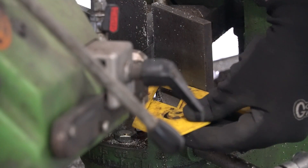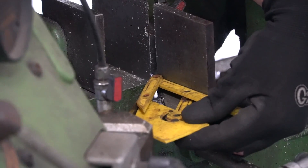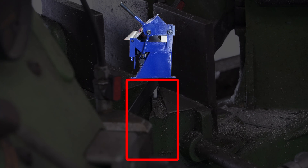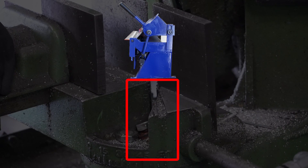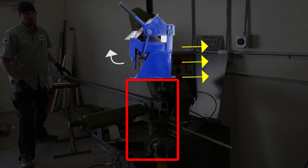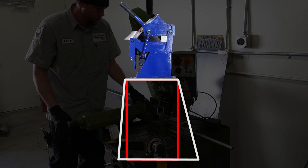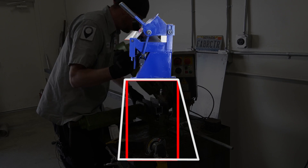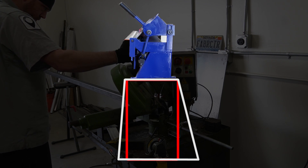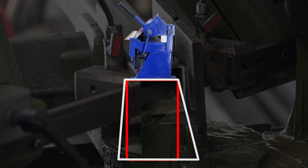There is a bit of a process you're going to want to follow here to maximize the amount of work you do with the minimal amount of cutting. First, you really need to have a design in mind. In this case we have our sheet metal brake, and if we have just a square space-saving design, we might run into problems — especially since we're going to be wrenching up on the leaf of the brake, which is going to make it want to topple over if we don't have any kind of support or bracing in the back. So we need a design that's going to allow it to be stable on the backside.